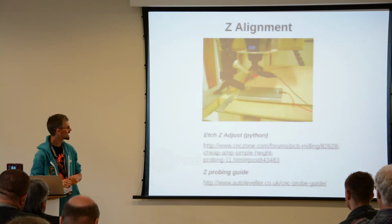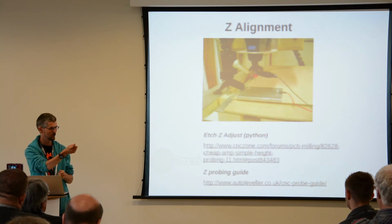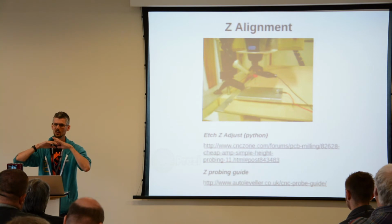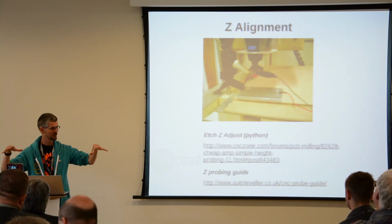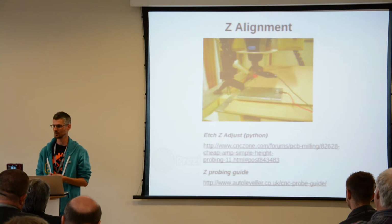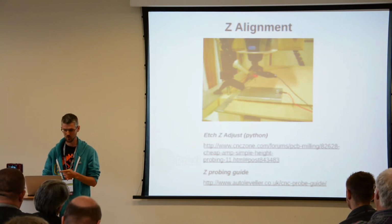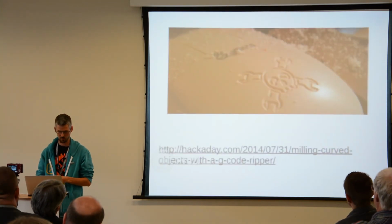So one thing you can do is attach a crocodile clip to your drill, have a little metal plate straight on your copper board, and then do an XY scanning and probing, generate a depth map of your bent PCB, and then wrap all of your etching parameters around that bent PCB, and then you're etching according to the top. And that is the difference between a usable SMT homemade board and something that is completely hopeless. So if you're doing PCBs, especially with fine pitch stuff, definitely look at that. It's pretty much impossible to do it otherwise.